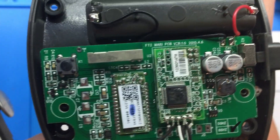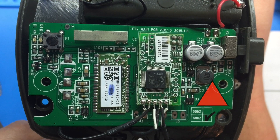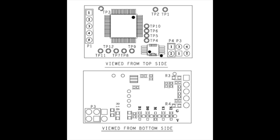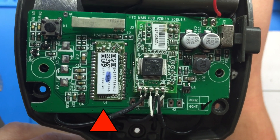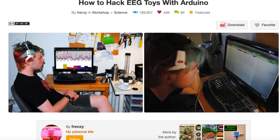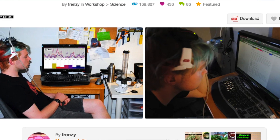Get this guy in the frame. Now what you can see right off the bat here is on the right hand side there's a voltage regulator - this thing is powered off of a single cell 1.5 volts, so it just steps it up. And this main board in the middle with all the wires coming off of it is actually a Neurosky board. It is an actual EEG board - I think I've found some of these on AliExpress. And then the next module over is Bluetooth, and then there's just some glue electronics: a switch, some LEDs, a few drivers, things like that. So it appears that this is an actual EEG system and it might be worth some further experimentation to hook it up and see what we can do with it. But we need to find a better way to connect these electrodes.